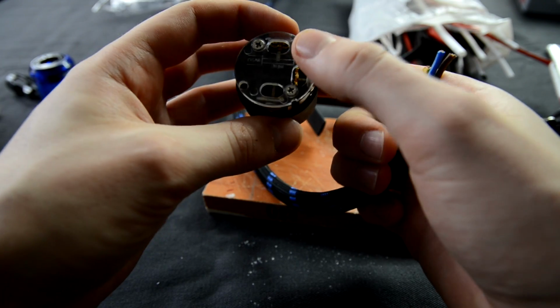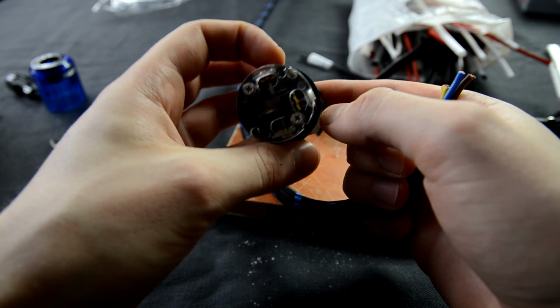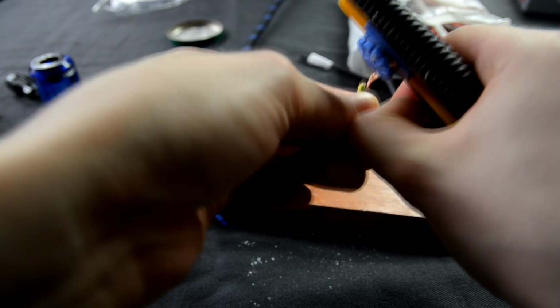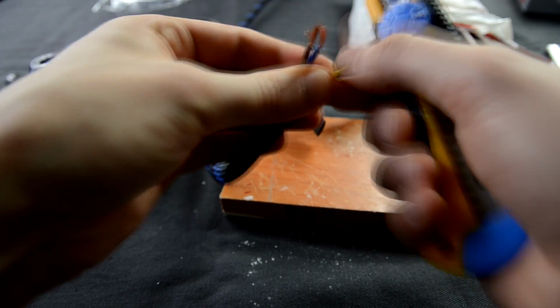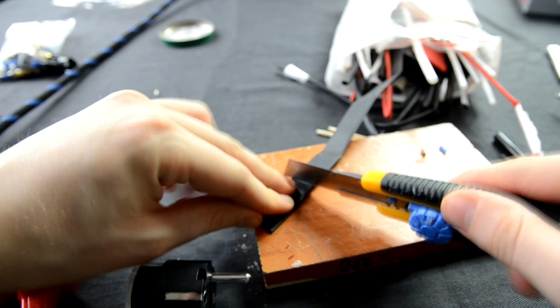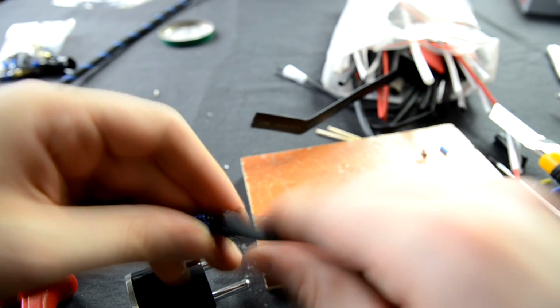For the other end we will use this Holland-made good quality Schuko IEC Europe standard plug. You will also have to remove the sleeve from those 3 wires, so you could work on them with a soldering iron. When it's done, just as before, apply a heat shrink tubing.